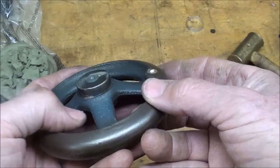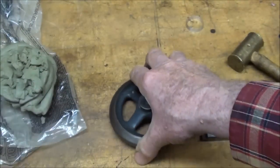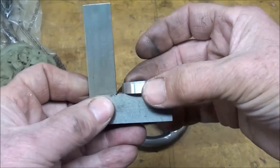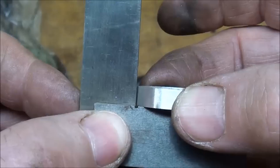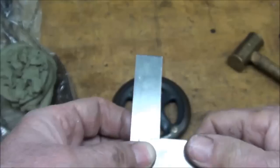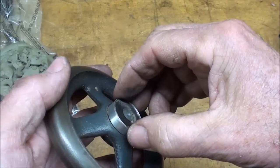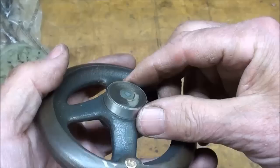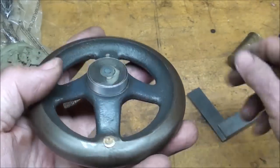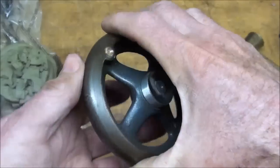In order to do something about that, I could have put this back in the lathe and put a three-degree taper on there. But what I did — and sometimes I go to way more effort and trouble than I should — I made a little sleeve here, and this has a taper on it. Can you see that it's tapered a little bit? It's been machined so it will fit over here, just a slip fit. And that has produced the taper that I need in order to withdraw this from the sand. So now I have my pattern ready to go.